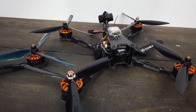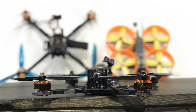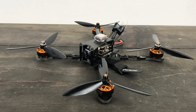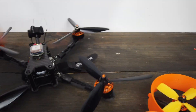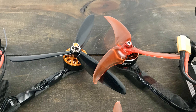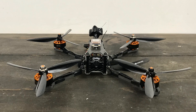What's up everybody, Jack from Half Chrome. This is the Tyro 119 - a pretty interesting do-it-yourself kit from Eachine, it's $119. Like all the Tyro models, the numbers tell you how much it costs. It's a 250mm quad motor to motor, with five millimeter thick carbon on the arms. These motors are big and beefy - 2407, 1850KV. The camera is a Caddx Turbo 16:9, 1200TVL.